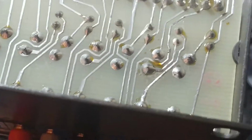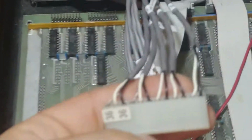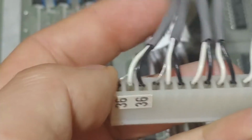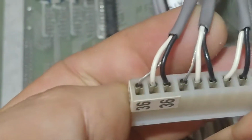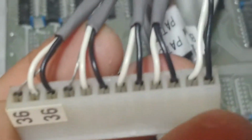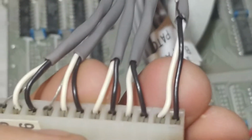These guys here have some circuitry on them where the grounds are bussed between some different connections. So obviously each of these connections has a ground and they're all common to one another, and that's all fine for this system here. But when I wire this into the Switchcraft Patchbay, as you can see over here for the patch out and the line in right here, there's a full balanced 3-conductor connection with the ground wire attached there. But then these three over here, that's not the case.